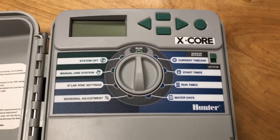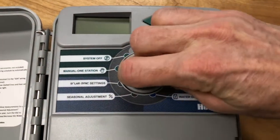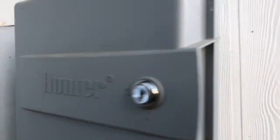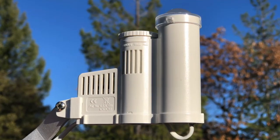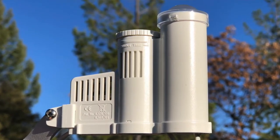Second, take a look at your irrigation controller. If you haven't already, put in your irrigation schedule for wintertime or modify the seasonal adjustment factor on your controller so it's appropriate for this time of year. Better yet, if you have something like Hydro-Wise, which pulls in information from the internet to modify that seasonal adjustment, or a solar sync sensor which measures your on-site ET value and modifies the seasonal adjustment automatically, then you're already set.